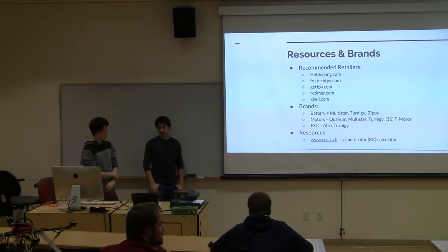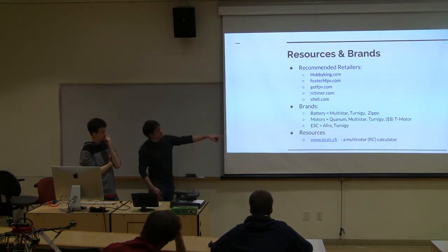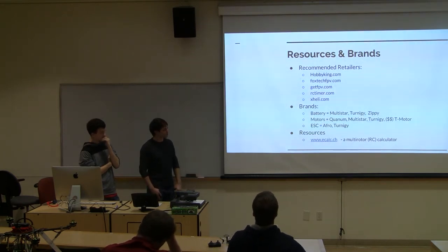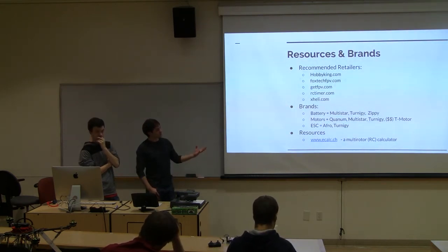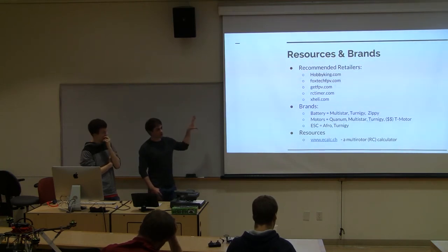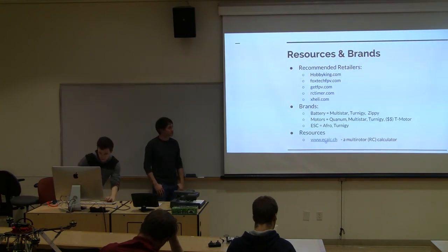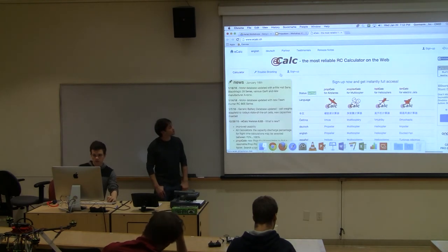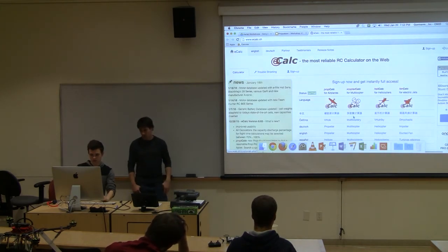Anything else? eCalc. Oh, yeah. Basically, this website, if you guys want to check it out, is an RC calculator. It will make the chart for you, from the last couple of slides. You can put in your info for your motor, your ESC, the prop size, and it'll give you all your info as far as flight time, your current, and everything. Very useful website.